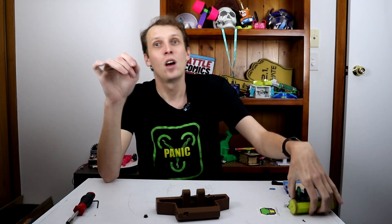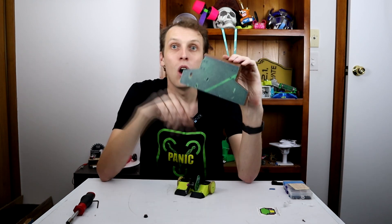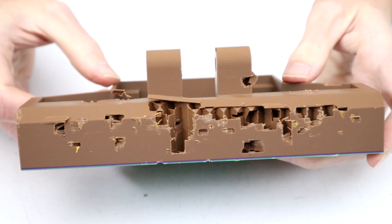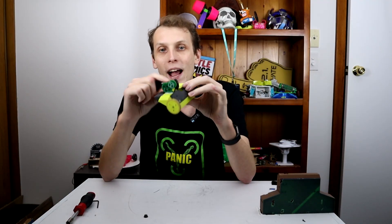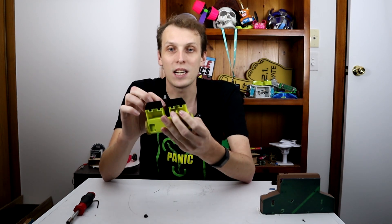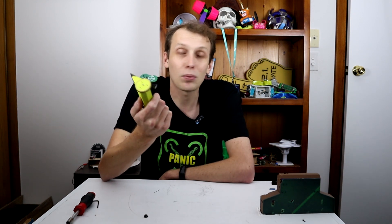That was brutal. Just the added speed, even in that tiny little test box, meant that the hits that we were getting were colossal. Those were much, much better than the last time we upgraded This Is A Party and put PCBs in it. I did just notice that the wedge got worn away a little bit — that is wild. We also could use a slightly heavier weapon; we're still managing to wheelie with these very, very fast motors, and I think we can fit it as well. I weighed the robot and it is like 5 grams underweight, so I can throw a bigger weapon on here, and I might even do that before the next fight. I am very, very happy with this upgrade. This thing is so much faster, but still actually decently controllable. I was worried that going to this kind of speed I was going to be very uncontrolled, but that worked out pretty well.